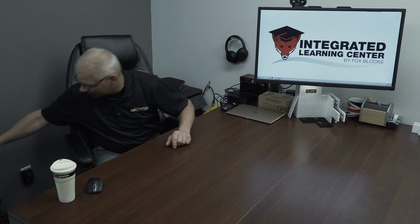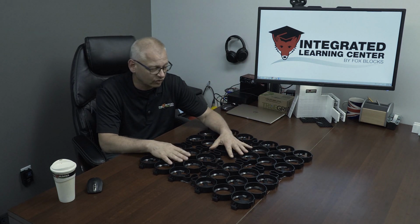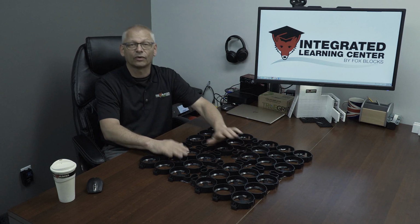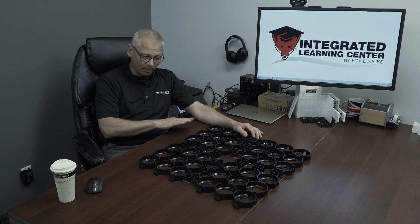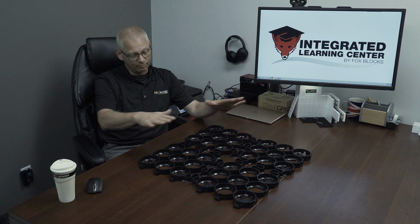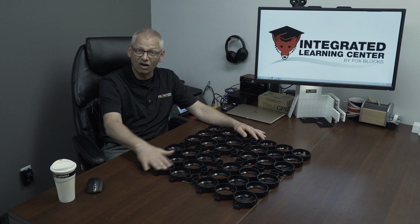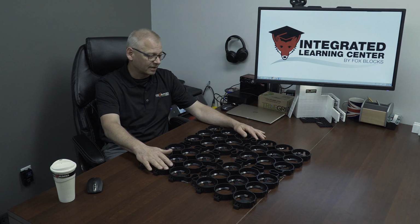You'll see here, Fox Blocks TrueGrid. And now what is this thing? I just want to show you some parts here quick. This is the Eco version, and it's about 1 inch thick. And this can be used for parking lots, for driveways, for walk paths, for golf cart paths, things like that. What you do is you do a base of limestone or rock underneath, level it off, put this on top, and then put decorative stone in here, or put earth and plant sod, plant grass, things like that.